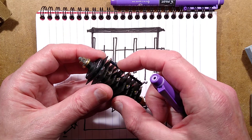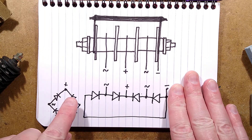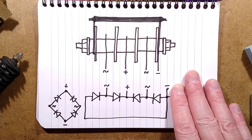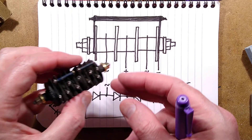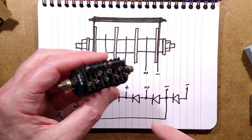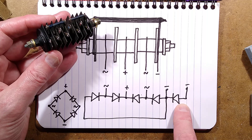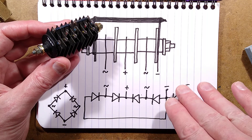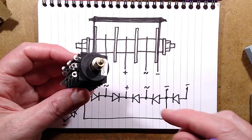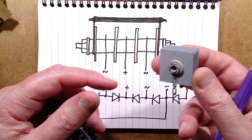There's a black wire at one end that bridges from one side to the other because it's in a straight line and loops onto itself — that forms the negative in this bridge rectifier arrangement. The two AC connections are marked with two yellow dots, the negative with a blue dot, and the positive with a red dot. There's an extra fifth plate on the negative end, possibly to create a deliberate voltage difference across part of the circuitry — it would have been tube-based. The whole assembly is coated black because selenium is a photosensitive surface and you can't shine light onto it.